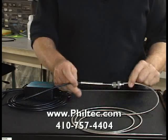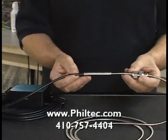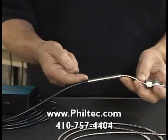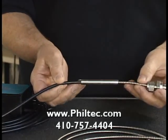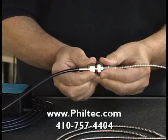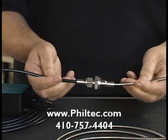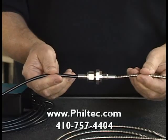This is an example of a single channel vacuum pass-through, which utilizes a compression fitting. The fiber optic cables pass through this solid cylindrical section and they are potted in with epoxy, and a compression fitting slips over that and is tightened to secure the pass-through. This is rated for 10 to the minus 4 — it's a low to medium level vacuum pass-through.